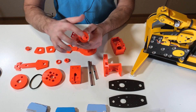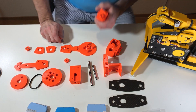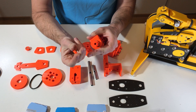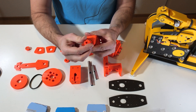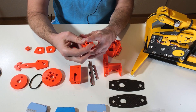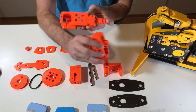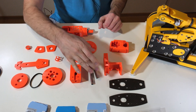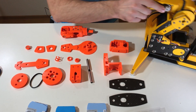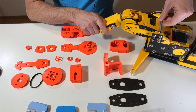To fix this axis inside this part I'm going to use these two pieces. There are small holes here for three nuts. The nuts are held by this piece, and afterwards when the nuts are inside, I can screw this piece and it will hold the entire axis inside. This is for axis number three — it's basically a tube which goes inside here.